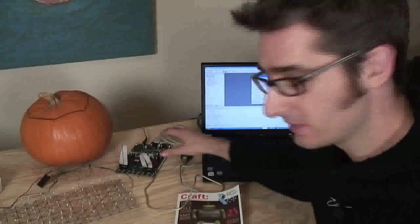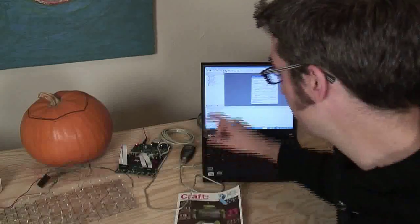For me, the most intimidating part of this whole project was actually programming the microcontroller. This is made pretty easy with the STK500, which is about $80, and is this little board right here. You plug this in and attach it with a USB to serial converter, then you load up the software to your PC. You want to make sure to upgrade the firmware, because otherwise you spend about three hours becoming very frustrated. Once you've done that, it's actually quite easy, and you upload the programs that you download off the website.